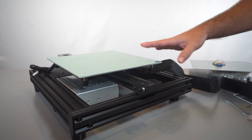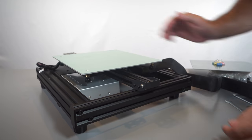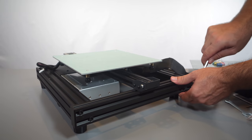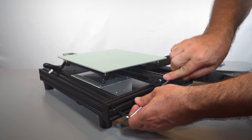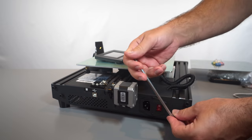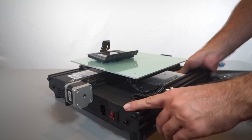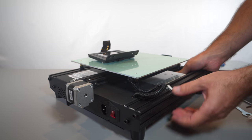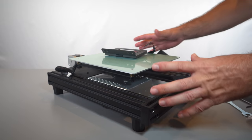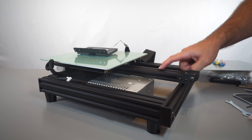Now let's check the bed. First I like to check the frame is straight — it seems very straight. The huge Allen wrench provided is for the frame bolts; let's snug them up since some were not tight enough from the factory. The rails here are 40x40 running across and a 20x40 in front — a really strong, rigid square. We also want to make sure the connecting rail is nice and tight; connecting on the ends is a much better design than in the middle.